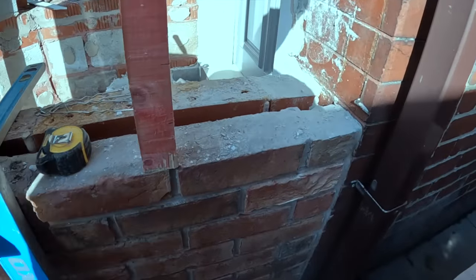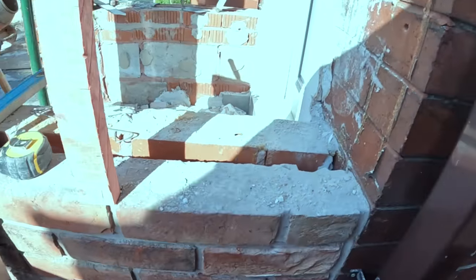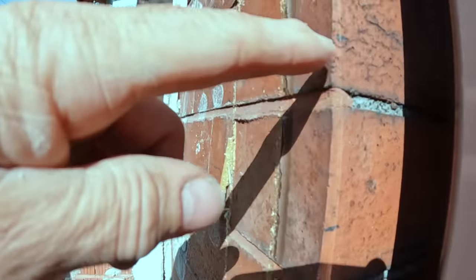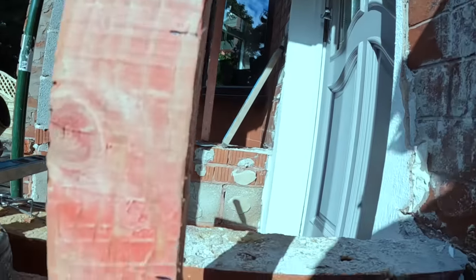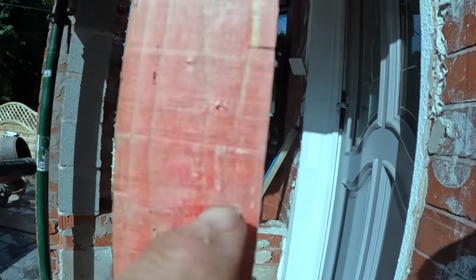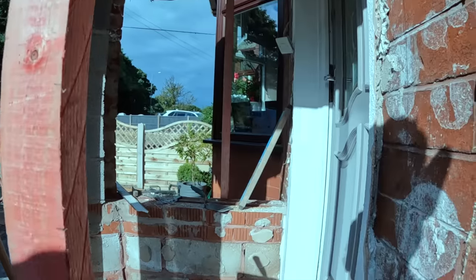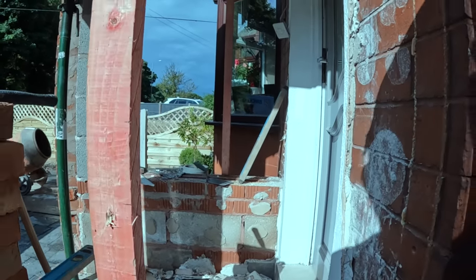Right, it's been a complete faff, but we're going to save time now. It's all about preparation. So, this batten's all level and plumb. I've got a gauge marked on the brickwork, because I'm going to just nail into this brickwork this side. And I've got the gauge marked up our batten. And to get gauge, it's 4 to a foot, so it's every 3 inch rather than 75mm, so it's slightly bigger beds. Works better with these bricks anyway.